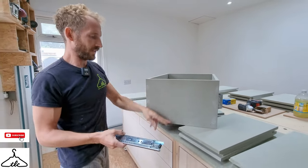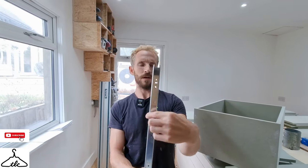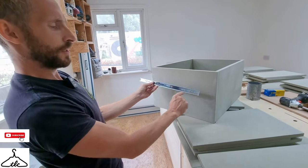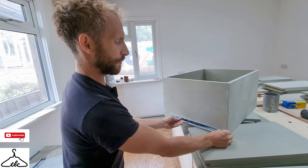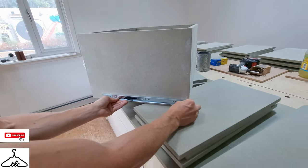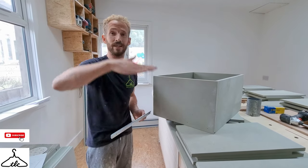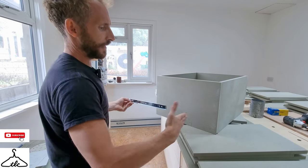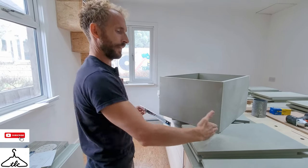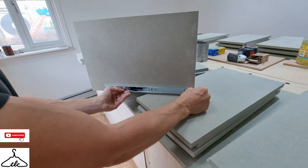So 22mm up, and with the smaller parts we've just made sure that is the front — not the pronged side. We've made that flush with the front, and we're using the oval holes — the horizontal oval holes, not the vertical ones. Because when we're screwing on, we need to make sure we've got that spot on in that direction rather than the other plane. Because we have got fascias going on — if we get these holes ever so slightly wrong in the forward/back direction, when it comes to fitting the fascias we can allow for that. But the front-to-back position where you want the fascias to all be in line — imagine you had 5, 10, 15 drawer fascias in a row — you need them flush at the front. Using the horizontal ovals allows you to move the drawer in and out on the runner.